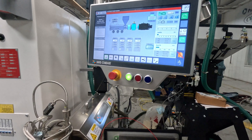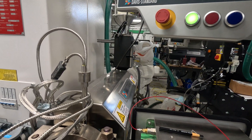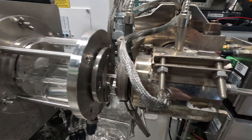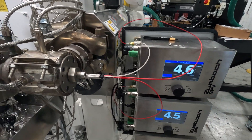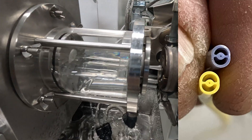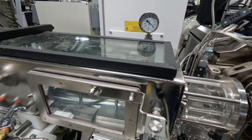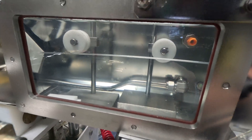The Davis Standard one-inch extruder heats up those plastic pellets across the screw, through the barrel, into the crosshead die. You can see the air boxes feeding these tiny tubes of air which create the voids in the tube. It's then sized as it goes through the pre-skinner, and further sized as it goes through the vacuum section of our Conair MedVac tank. You can see the product passing through there.